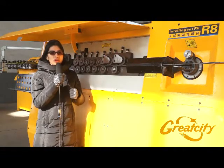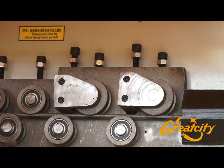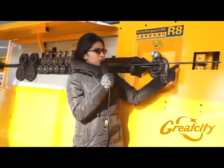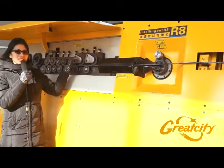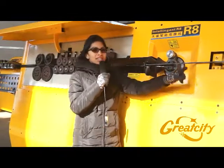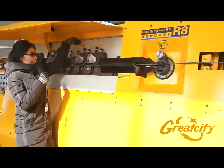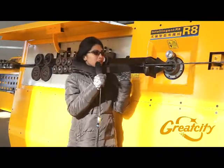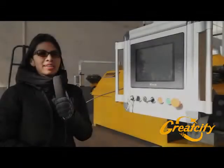Before cutting or bending, go back to one particular wheel. When you move the wire forward until it reaches this area, if you see that the wire is going up, you have to loosen this wheel a little bit from this screw. In another way, if the wire goes down a little bit, you have to tighten this screw. The wire normally has to be in a straight line.